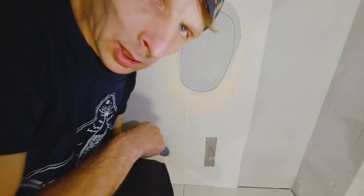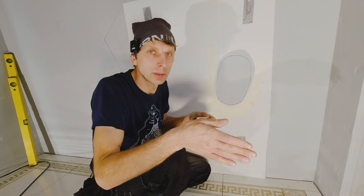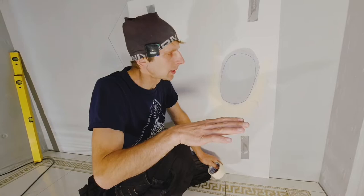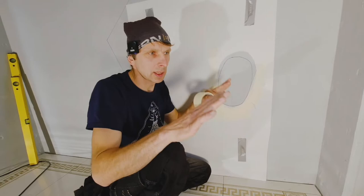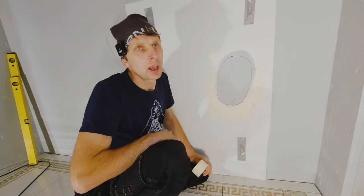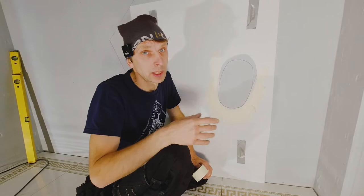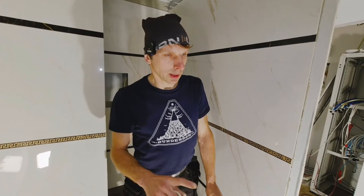The stencil is also used in complex floors when we have many angles and curved walls or angle-shaped things on the floor. We can do a stencil on the floor in the same way. We put tile on a dry wall in a separate room, then put a stencil on top of the tile. We make a contour and then, in one shot, we cut the entire tiles for the whole floor. Of course, if the room is bigger, there are many other ways to take dimensions and transfer them to the tiles. The one we showed today is just one option, but there are others available.